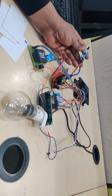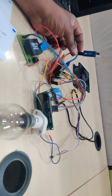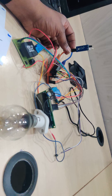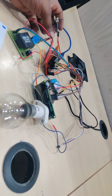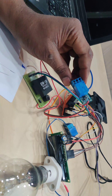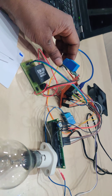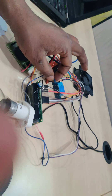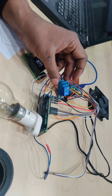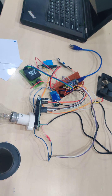The infrared sensor is a digital sensor connected to an I/O pin of the controller with VCC, ground, and output. I am using two 5V DC relay modules — one for controlling the bulb load and the other for controlling the fan running on DC. A relay is a simple electromagnetic switch that takes a DC pulse and controls AC or DC loads.